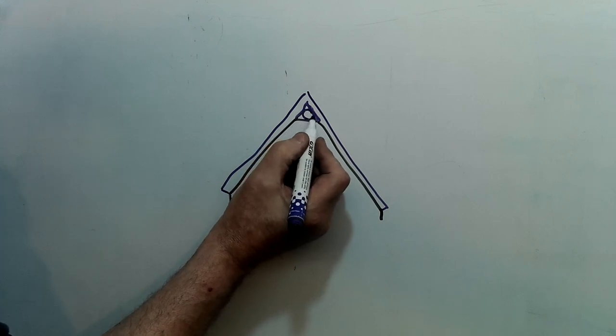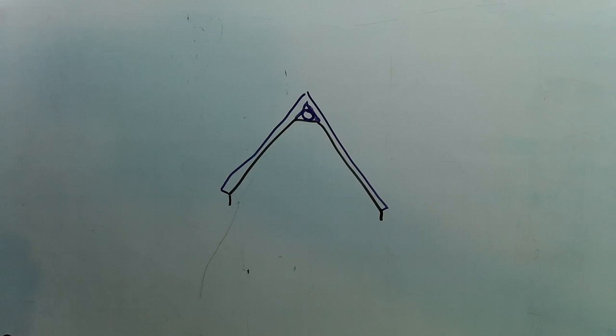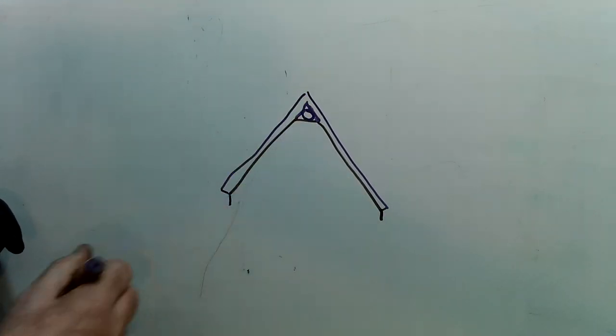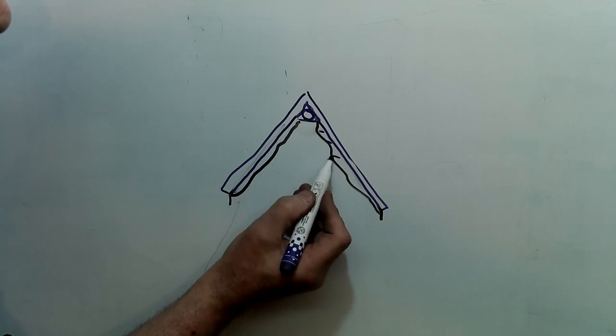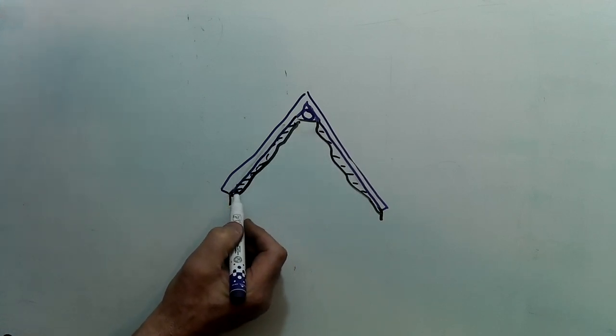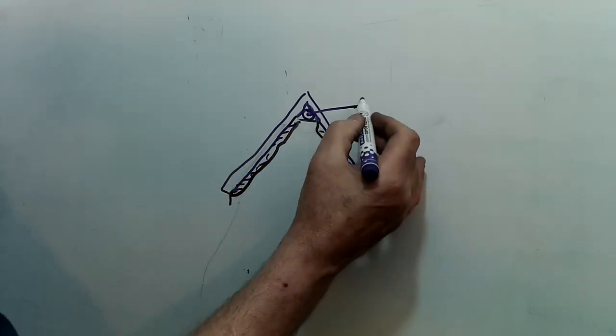And if there are a number of 1.5mm dowels all the way along the top of each V-way, then the angle material will be held in the correct position for the epoxy to set. These 1.5mm rollers were slightly oversized to allow me some wiggle room when I eventually scrape in each slide.